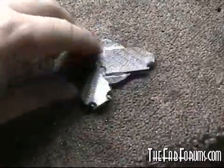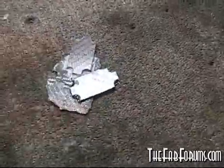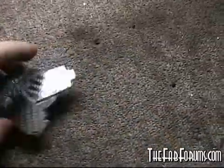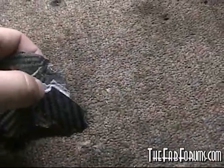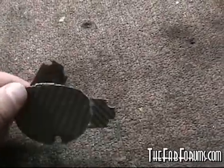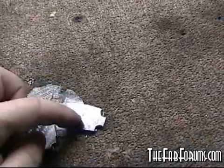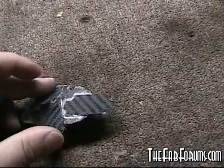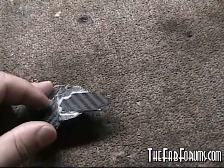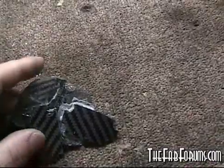This one here works a little better than that standard tube epoxy, but I've also found that the JB Weld type epoxy — you can see it's gray in color — holds extremely well. I actually worked on this test piece with both hands trying to get it off and I just don't see the two pieces separating without actually breaking up the fibers themselves.